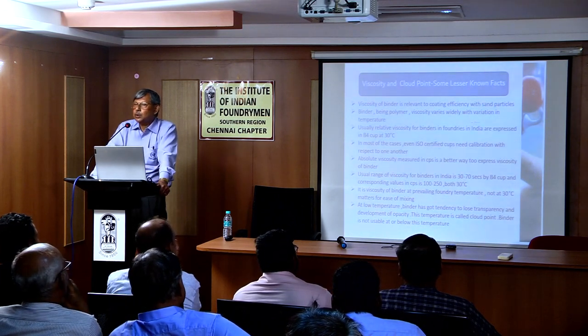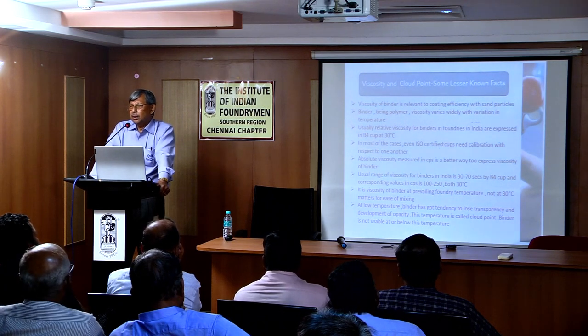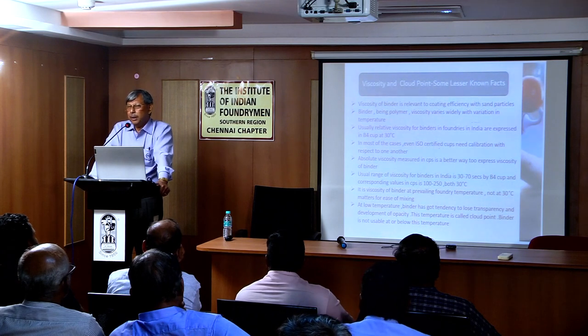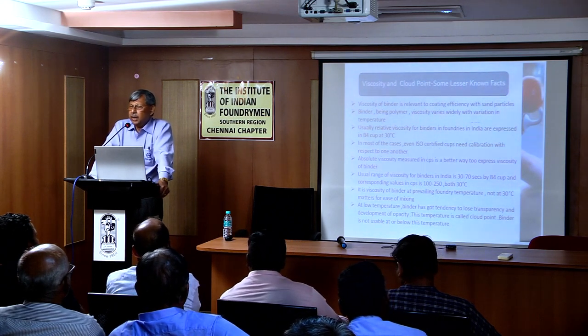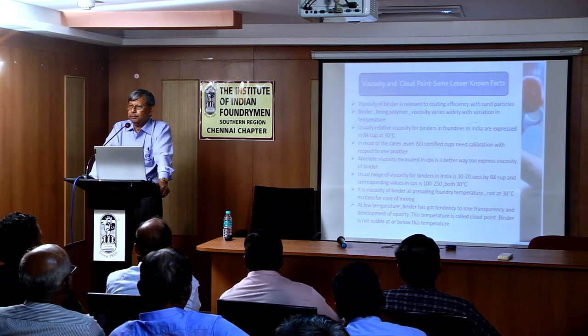So now comes the viscosity. Many of the foundries for cold box specify the viscosity and many don't specify. Many feel that the lower the viscosity, the better. So definitely there is a logic behind that. Lower viscosity means it will mix easily and the sand particles get coated properly.